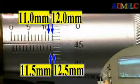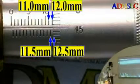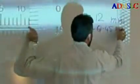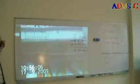I'll put it to another reading and I want you to give me the reading. Who can tell me? 12.46 — let me check. This is 12 millimeters plus 0.45 millimeters plus 0.01 millimeter zero error, and this gives me 12.46 millimeters.